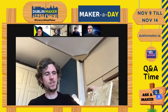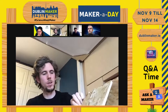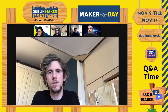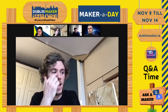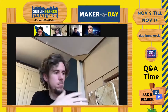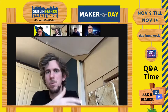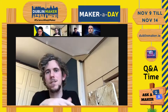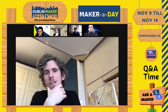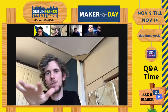Like there's grain everywhere, and it can get quite messy, so you can sand it down just to a regular finish, and that actually works quite well, which means that you're not going to get splinters off the top of it. But generally speaking, if people are putting furniture or things like that into it, for people to be sitting on or rubbing against, they would use something like polyurethane and put it on quite thick so that it covers over the grain of the wood.